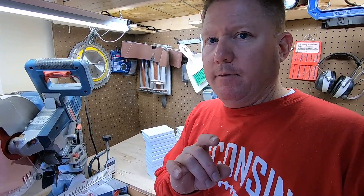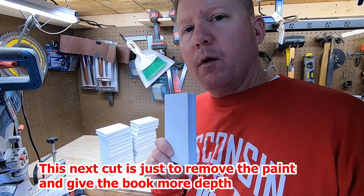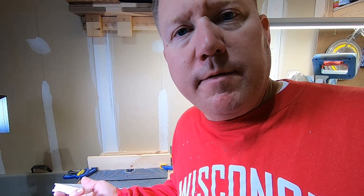The wife's request is complete. Or is it? I have one more idea — we can give these things just a little bit more depth. What if we did one more relief cut with the router? Let's give it a shot. I'm still set up with the router table, I just need to raise that up a sixteenth of an inch.